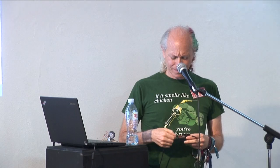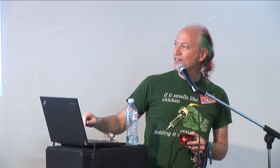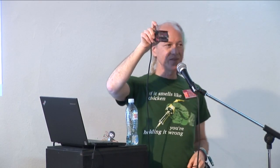All right, so let me turn that off. I'm gonna hack this program a little more. I'm gonna put this back to the way it was before we started hacking on it. So on for a tenth of a second and off for a second. Then I'll put that in memory by doing this. Uploading. And now it's done, and now it's doing what it was doing when we first finished soldering the Diavolino.